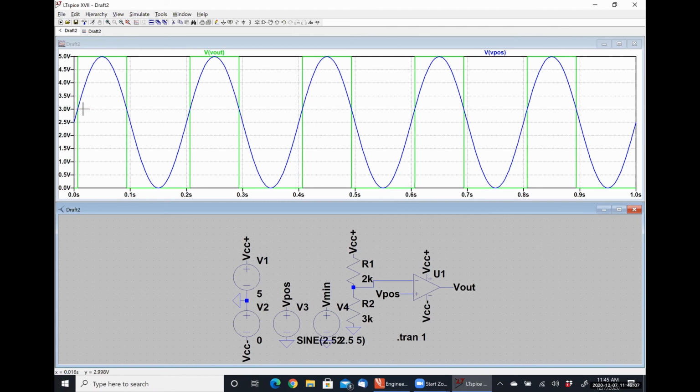So we can see whenever our input voltage goes greater than 3, we swing high, and whenever it goes less than 3, we swing low. So everything's behaving like it's supposed to be. Now, before I let you guys out of here, this is a very simple question: what would happen if we had a noisy input signal? Meaning that if around here it oscillated, right?